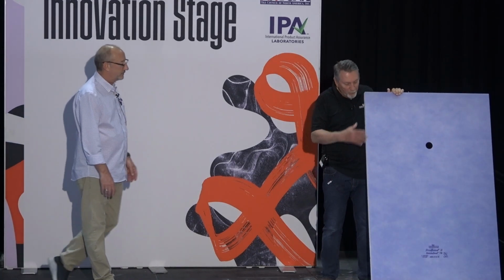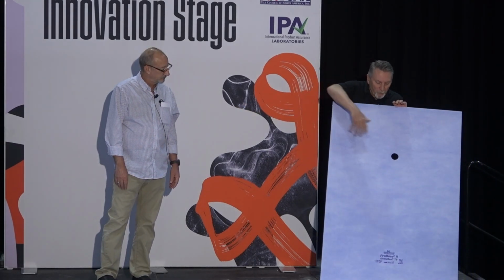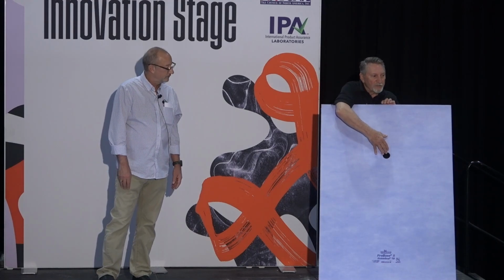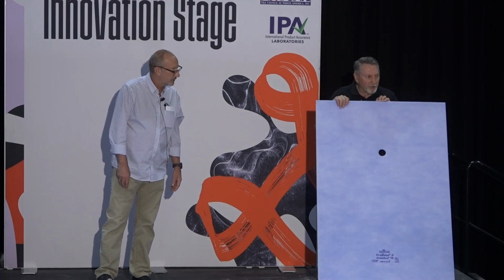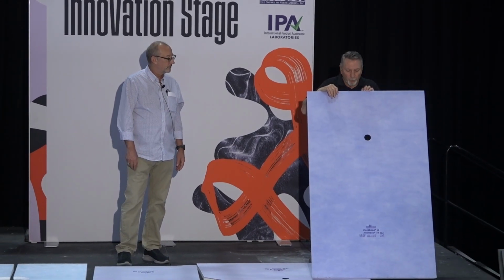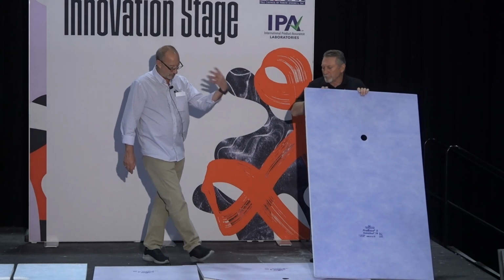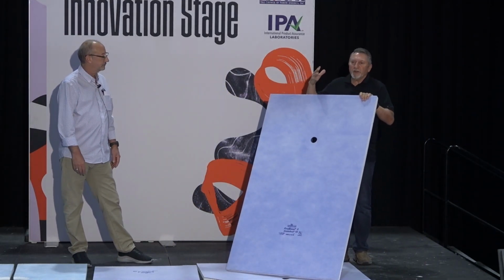Now, with the point drain, we require that you be no less or no more than 10 inches from the edge. Otherwise, you've got quite a slope at that point, because all of our perimeters are a uniform thickness. So just to give you an example of the thicknesses.